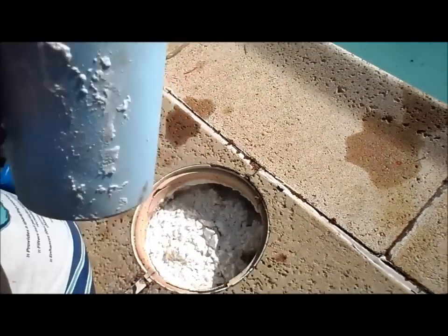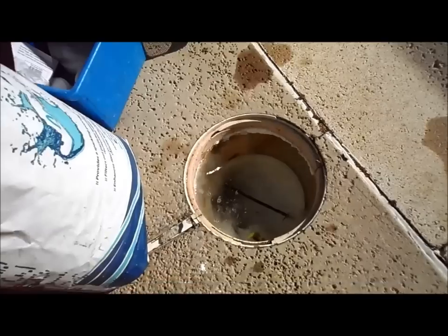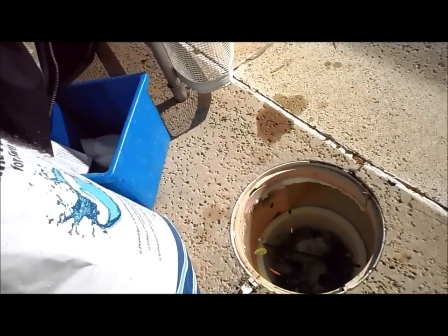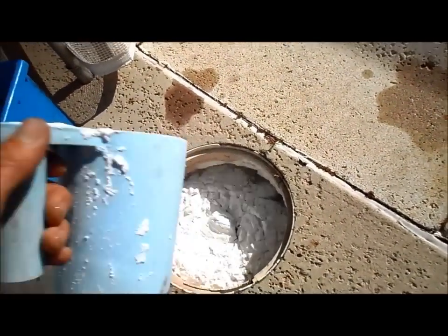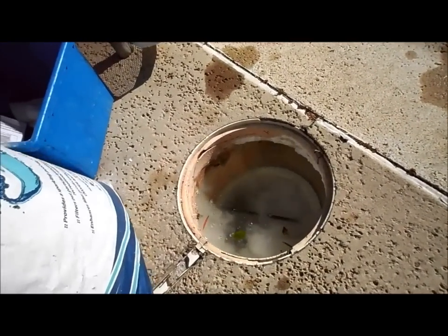And I like to put one in, and just to make sure that there's no blowback in the pool, so let me check the line. And as you can see, there's no earth coming back in, so that means the filter is sealed without leaks. I'm going to put the rest of the earth in slowly. I like to put it in slow, that way the pump basket doesn't get clogged up. And that's 2 right there, and I'll put the rest of it in.